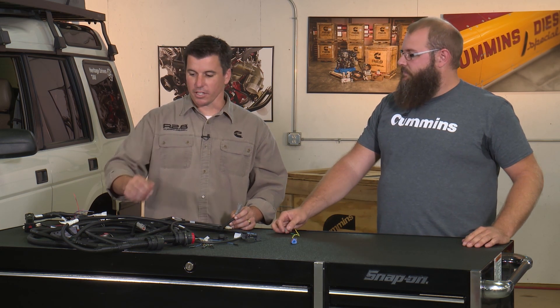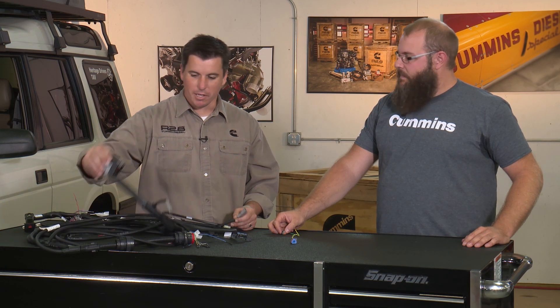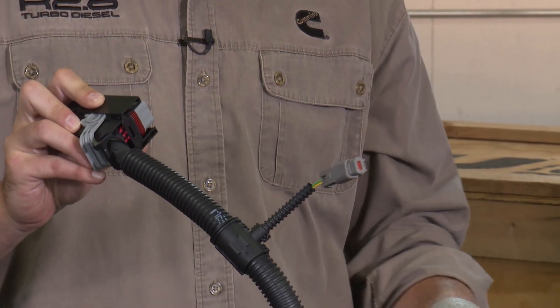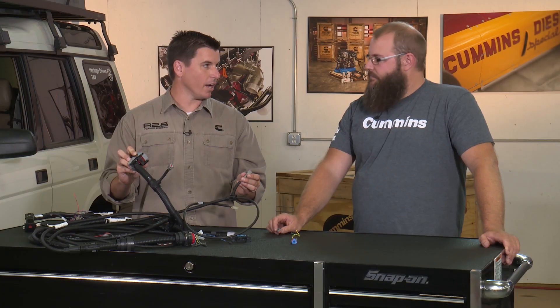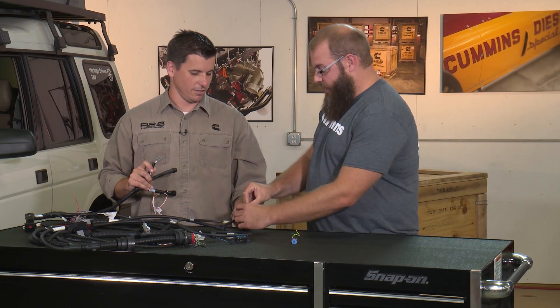So, as tempting as it may be — here's your ECM plug — do not T in by getting rid of your terminating resistor here right by the ECM, or the one on the inside of your harness. So where do I plug this in? Well, I just took it out and I'll put it right back in the harness so we don't lose it.